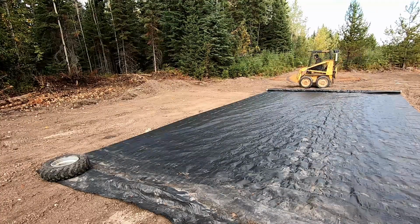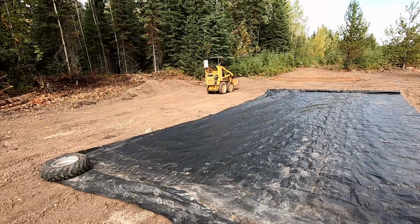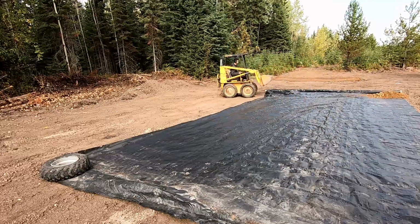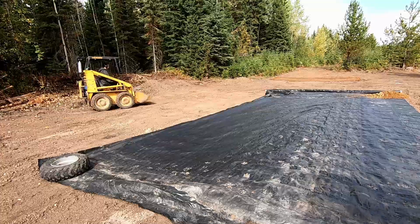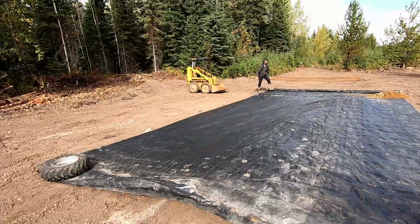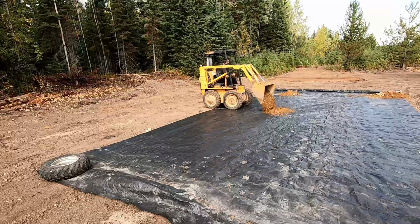You might notice sometimes when I'm in the skid steer, I do some odd maneuvers, backing up and forward to turn. It's usually when the machine is cold, the left side pump and motor don't really have any power, so I have to work them a little bit, about 15 minutes until they start working properly. After that, it seems to work okay.